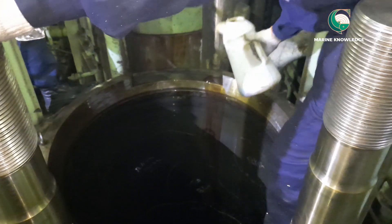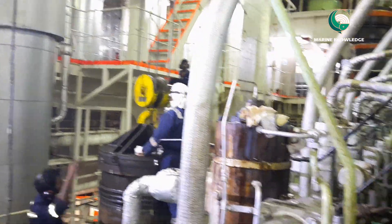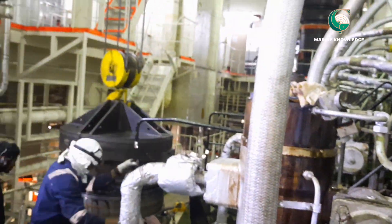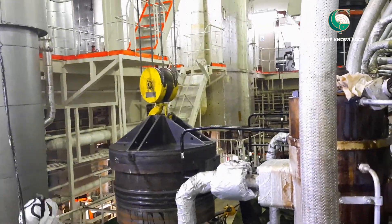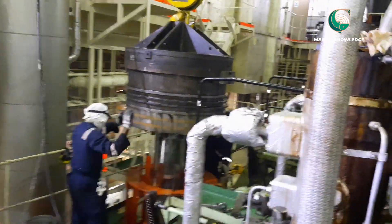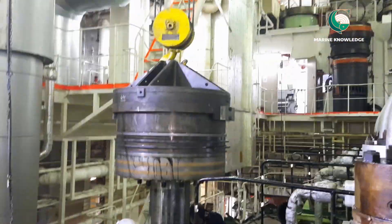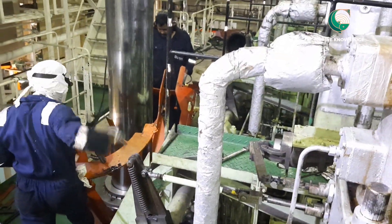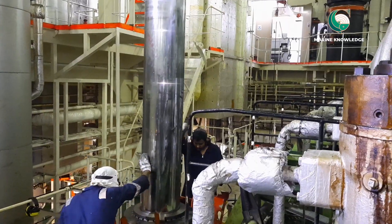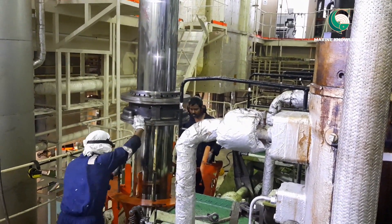This lube oil plays a major role — don't be stingy, use ample amount so the entire cylinder liner is covered. On the other side, people were using the crane to fit the piston lifting tool and carefully lift the piston from the stand. The main thing to notice when lifting is that there are chances for the stuffing box to get stuck at the floor plate area, so be very careful when the stuffing box is coming up.